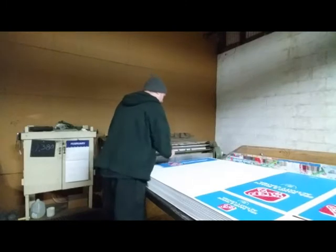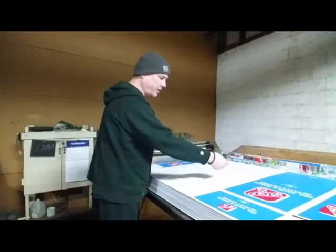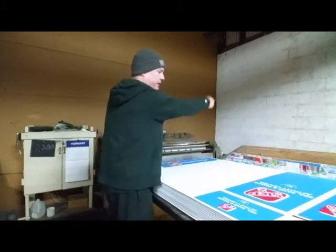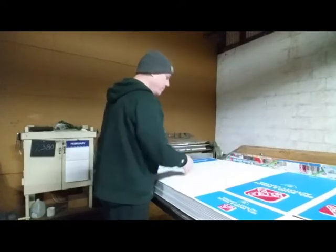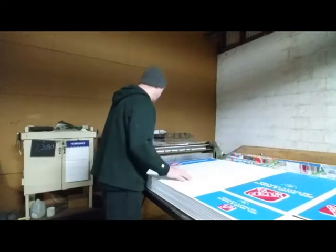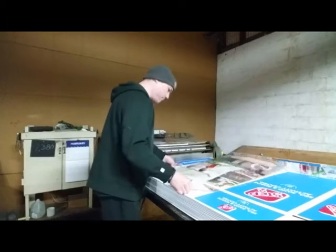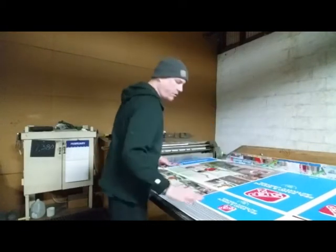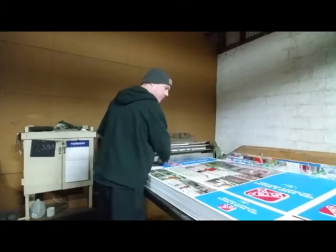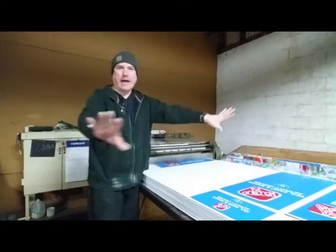And you bring it through. I grab it in two places. I grab it here and here, and then midway I move my hand here to grab it and finagle it. But you got to get the float down. Some people will pick it up and put it down. Me, I don't know. Doing it for many years, it's easy. So you grab it, float it right on the box. You wipe this end down. You can go up or you can go down and right down the middle. That's all you have to do. The rest of it, you run it down there, it squeezes the bubbles out flat.